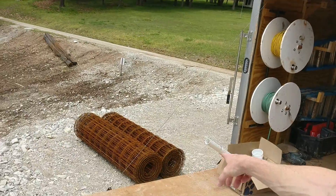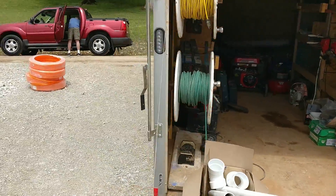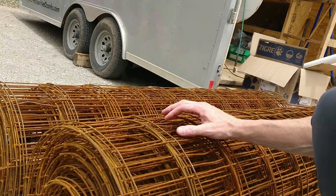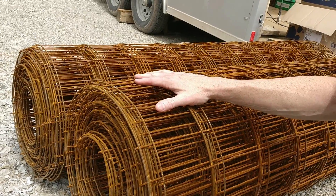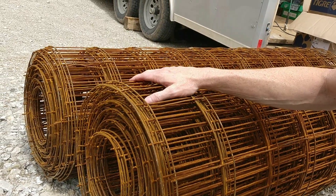It's just after lunch and they already have half the insulation laid. Then they will roll out this metal — it's like a wire metal, about a six-by-six square grid. They'll roll it out and that's what the radiant floor heating will attach to.